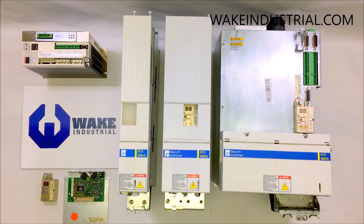DKC drives use both option cards and encoders, allowing for a wide range of functionality depending on the specific attachments to the drive itself. For example, a DKC 200 amp drive such as this one can use analog, Sercos, Profibus, DeviceNet, Interbus, CANopen, and other option cards depending on the tasks that need to be completed in the automation environment. All of these option cards have a correlating encoder that must be used to program the firmware correctly onto the drive.